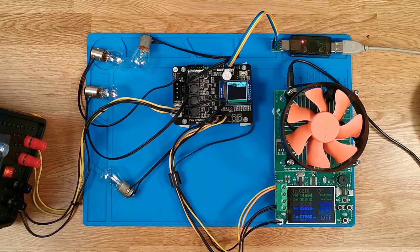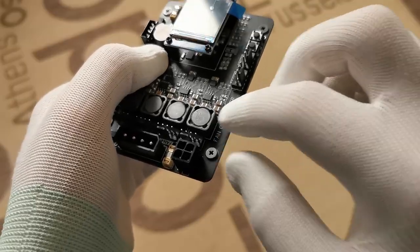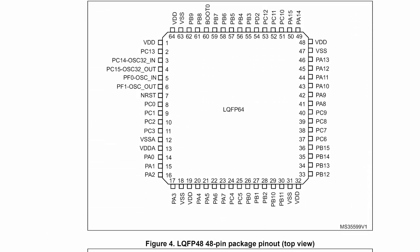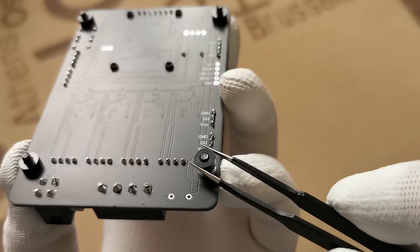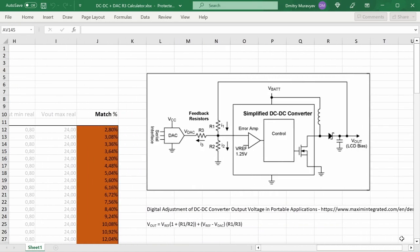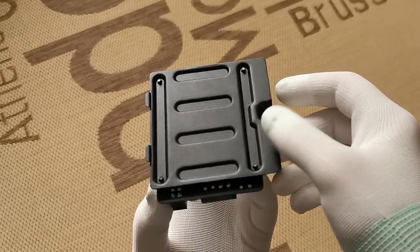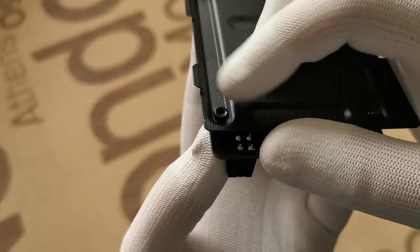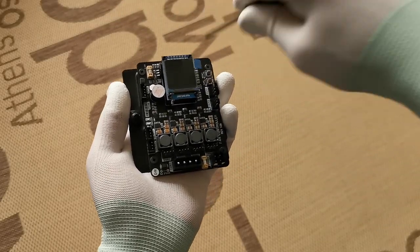A couple of words on what could be improved. First, colleagues, write your ideas in the comments — I read and reply to almost all of them. I think it's worth removing the separate fan controller and doing everything on one MCU. Voltmeters on the unregulated fan channels — already mentioned. DC-DC control could be done with DACs instead of digipots: cheaper, and the math isn't much more complex. The chip manufacturer does note these digipots are not recommended for new designs. On the other hand, these specific digipots have an automatic mode and built-in temperature sensor located right next to the DC-DC chip on the board, which is both useful and convenient. Not sure — there's plenty to think about.